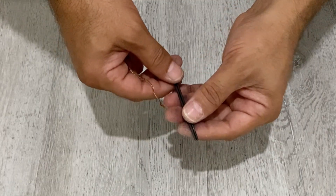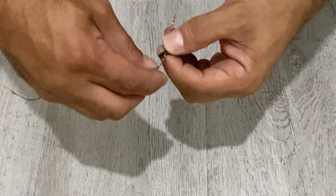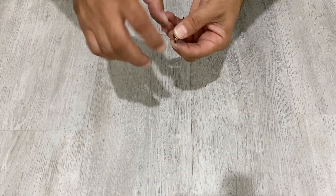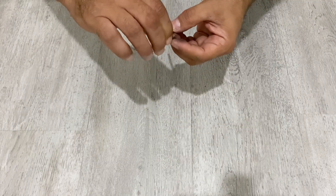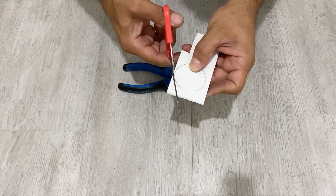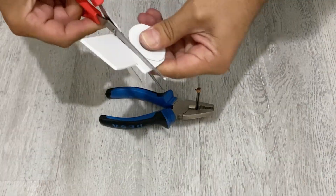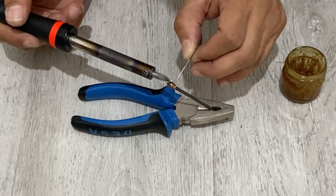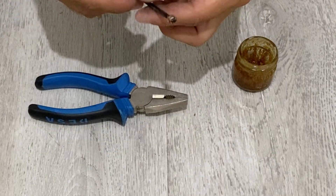For the cathode, I'm going to use two pieces of graphite rod and one piece of copper wire. I'm going to wind this copper wire around the graphite rod — be careful because the graphite rods are fragile, don't break them. Cut it out, then cut the plastic part for the second one. We then solder our graphite rod.